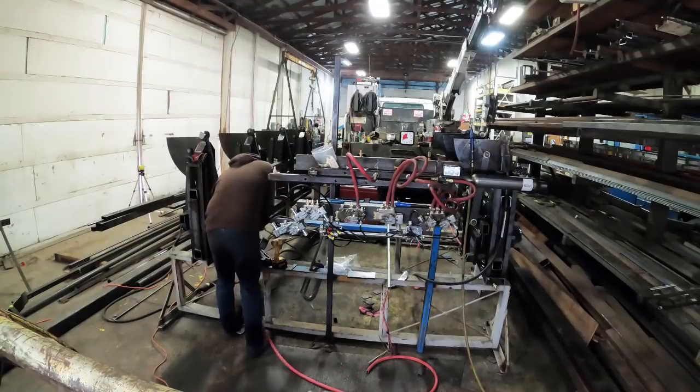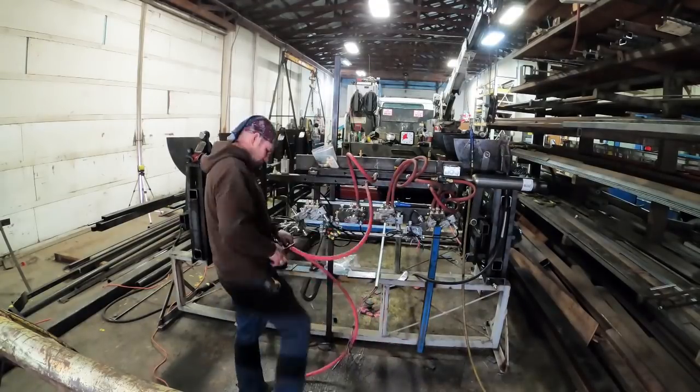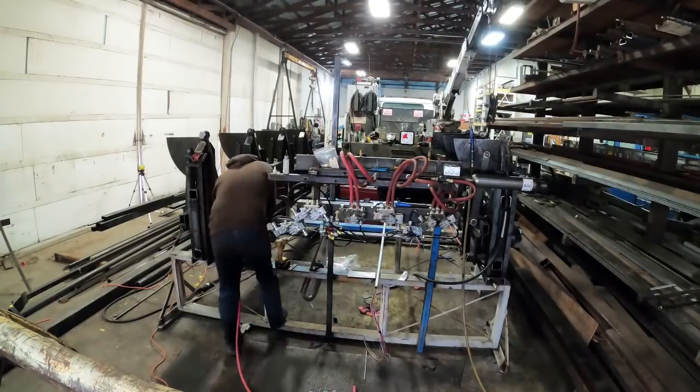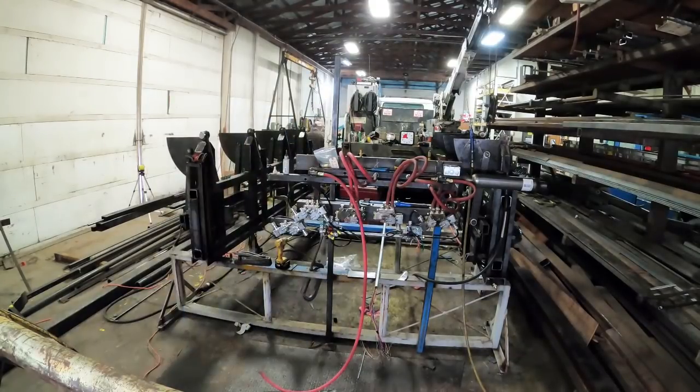I'm going to have an air tank feeding it so it's got some capacity to separate water if it gets any in it from extreme winter conditions. It also gives a small air supply, so if there's surges of air in the system, they're contained in that tank. And I had to go back over to the mill.